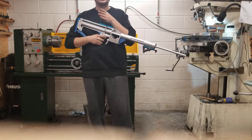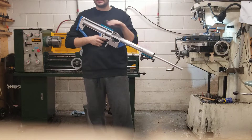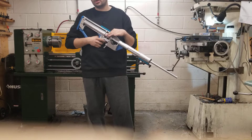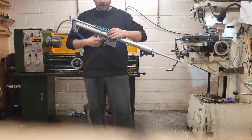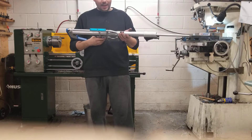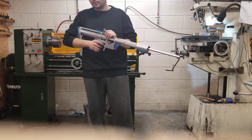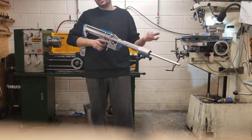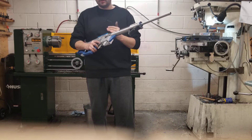Another change: instead of the plate system for the priming mech in the back where the ram is, it's milled out of one piece — exactly the same concept as the 3D printed version, with a disc and cutouts for the bars to sit into, except it's milled out of billet aluminum, so it's basically going to last forever. I also made the knurled thumb screw this time, which adds a nice touch.